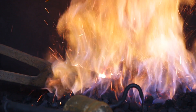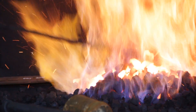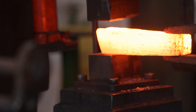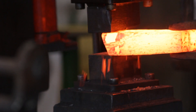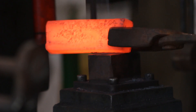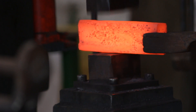I could weld a handle onto this to make it a bit easier but I do have a pair of big old tongs which I will use instead. To start off with I will get some heat in there and I will forge it down to approximately 50 by 30 under the power hammer. That goes an awful lot quicker under the power hammer than doing it by hand — I would still be at it if I didn't have this mechanical marvel.